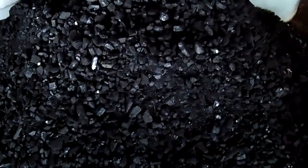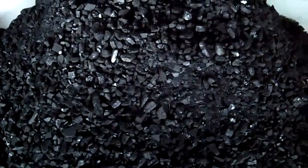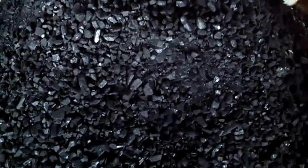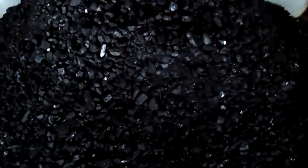I've got a decent batch of charcoal going, laid some out from the one pail, and there's my stash of coal. It'll be happy firing for a while. With as many volatiles that burn off when firing with coal, I wanted to see whether I could coke it up or not. If it works out well, I'll be buying a lot more paint cans and trying to do a whole bunch of them in one firing — or I might convert one of these 55-gallon drums I've got into a little cokery.